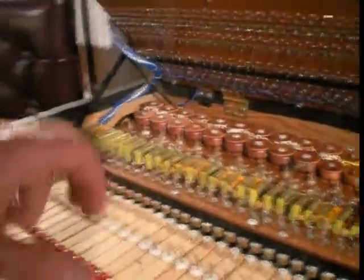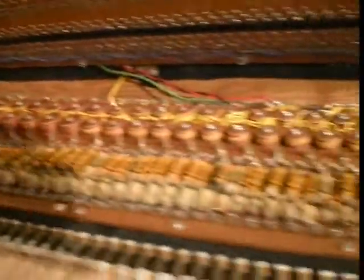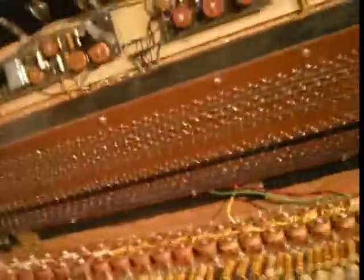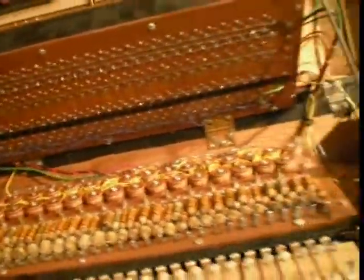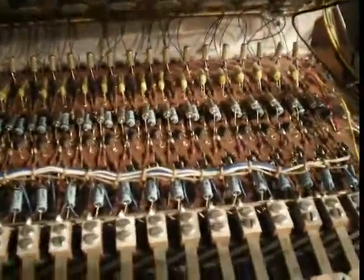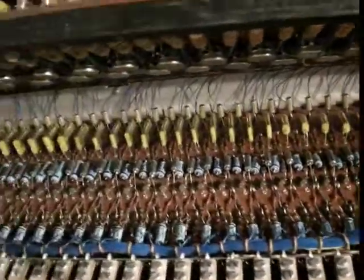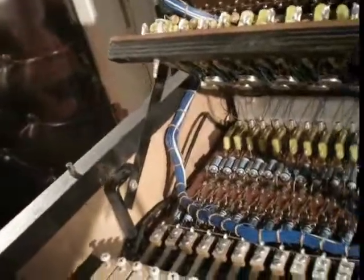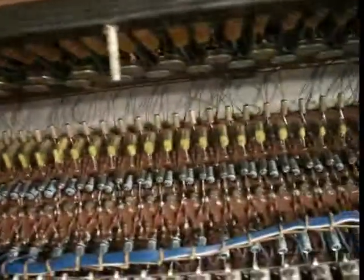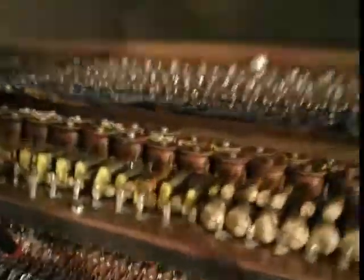I'm going to have to pull these screws — the screws here go through everything. You don't pull those; you pull just the Phillips ones. And you can pull this front tray up, I believe, if you can find your tool. Oh, there it is. This is the layer that we find above that, and here we actually have some transistors, diodes, as well as capacitors and resistors for the first time in the circuit. On the next level, it is purely capacitors and coils and resistors — as with all the filters, I didn't see a single transistor used anywhere.